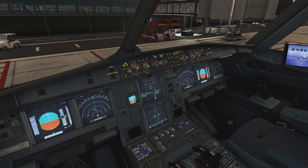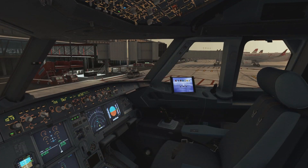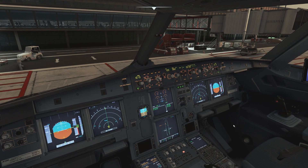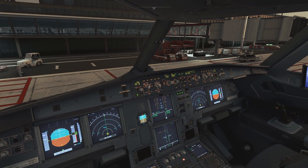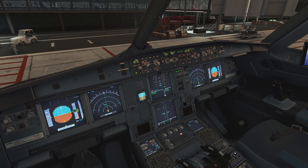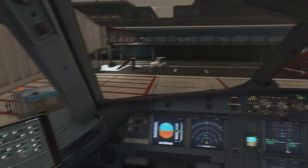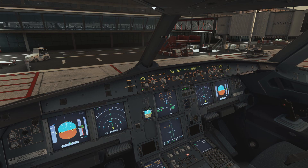That's a risk, which is why some airports de-ice the aircraft just before you enter the runway. The advantage is that the aircraft gets de-iced, you enter the runway and take off — it doesn't matter how much it snows or if there's freezing fog, you'll always have a clean wing. The disadvantage is that you have to do it with engines running, and if there's a lot of aircraft de-icing you wait in line, producing noise and pollution. It's also different in terms of cockpit procedures — the gate procedure for pilots is not so straightforward.